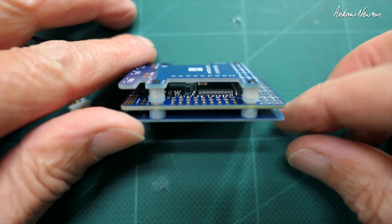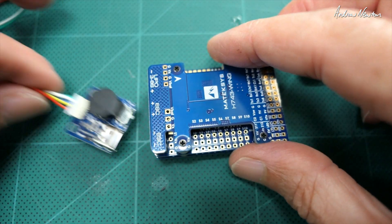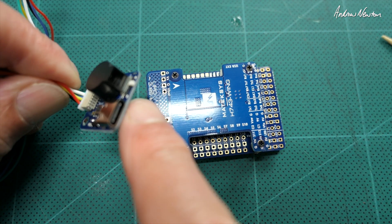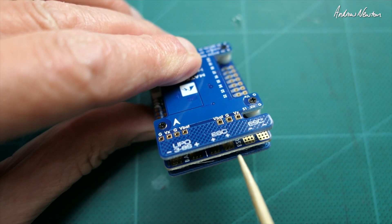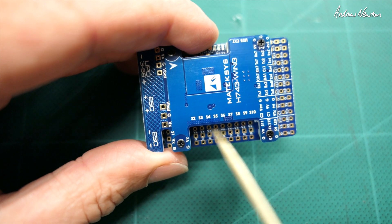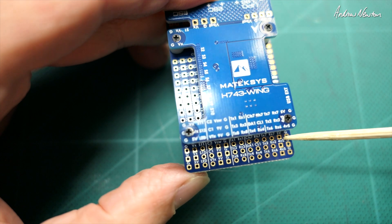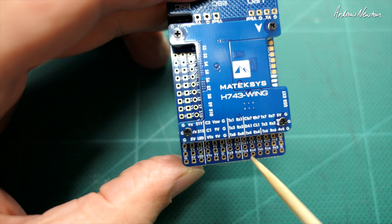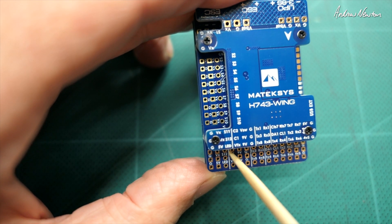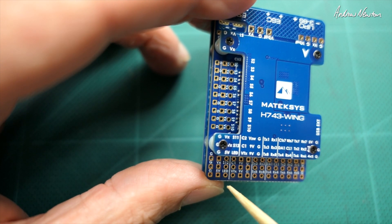So as you can see it's a triple deck — the bottom deck is just a mount, the top deck is all the voltage regulators and BECs. We get the daughter board breakout as well with a super loud buzzer, a little on/off switch, DFU button, and USB-C connection. Starting at the power end: battery connections there, two ESC connections with ESC signal and ground. Down this side we have nine servos. UARTs at 6, 2, and 7. I2C connections, UART 4, UART 1, and UARTs 3 and 5. Video transmitter, camera 1 and switchable-voltage camera 2, and PWM outputs 11 and 12.